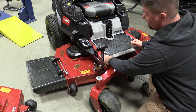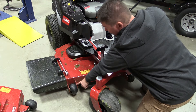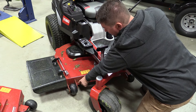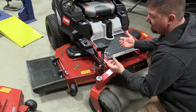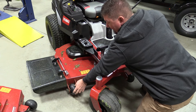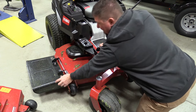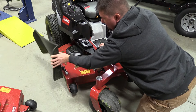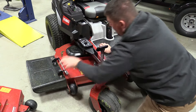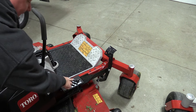When you move up to the Titan you have a little bit more beefy frame, and a very similar deck, but the leading edge here is bullnosed. That's a little bit stronger — it's ready to hop up over stumps and keep you from damaging the deck. You have the same anti-scalp wheels that move up and down, and on this model you have more of a rubber chute, so if you hit a tree it's just going to flex out of the way. You also have a larger foot placement system for raising the deck and a few more options for deck height.